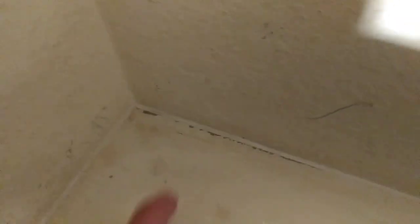I can feel it just pushing right into the joint. The joint's filled all the way across. That's just where it's unpainted at the edge — the joint's filled. Now I'm going to start here at the top, squeeze just a little, and lay it right into that corner. That little gap is okay because it's going to get filled. Now we're into our other caulking — I'm just going to take this and push it into the joint. Done.